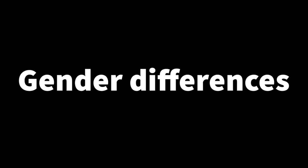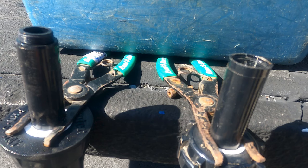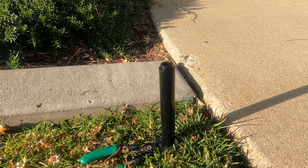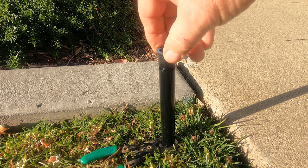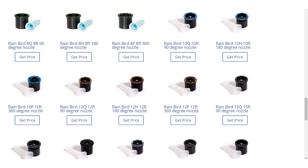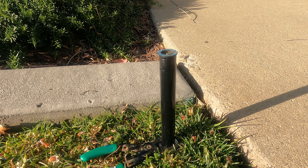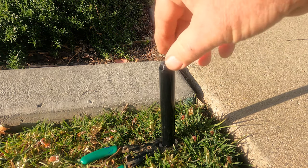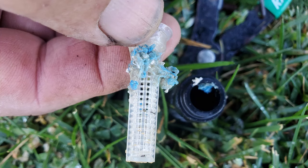The gender of the pop-up is dependent on the nozzle thread, and each manufacturer decides whether they want a male or female design. Is there a better or worse design? Yes, and I'll explain why. When you install a female thread nozzle you simply drop in the proper screen or filter and then screw on the nozzle — easy. When you want to remove the nozzle and screen, you unscrew the nozzle and easily grab the screen. Even if the screen is full of crud and stuck in the shaft, you can still easily grab it with needle-nose pliers and remove it.